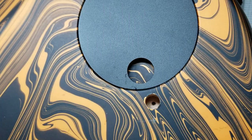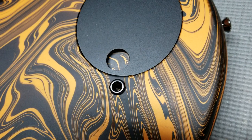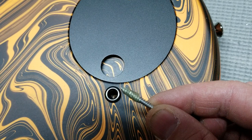And the hole is complete. We have a nice, beautiful 3/8 inch hole, 1/2 inch deep, and the button just drops right in the hole easily. And I'm gonna put some Ken Smith classic wax polish on this screw, and we're gonna screw it in and we'll be done.